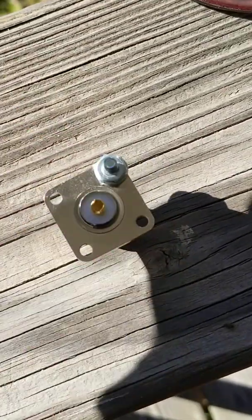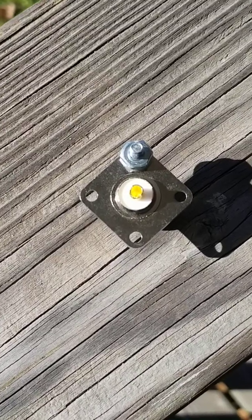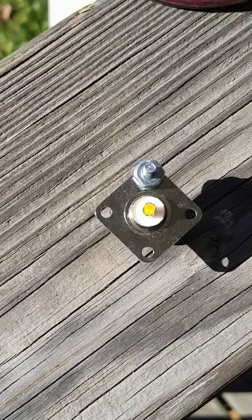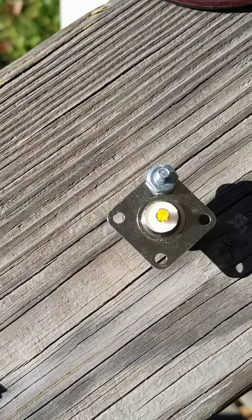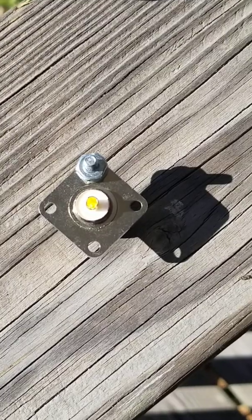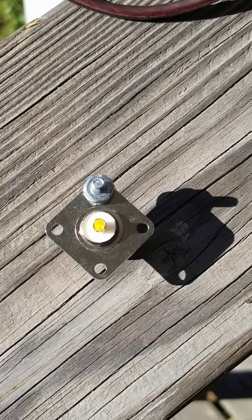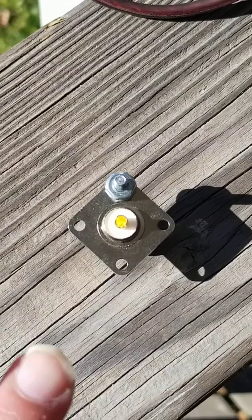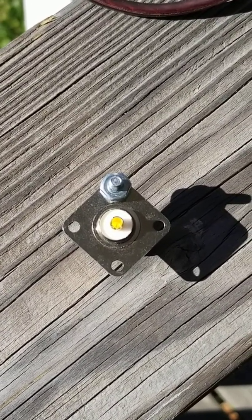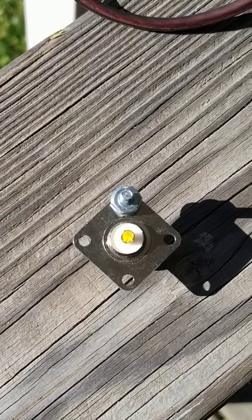I'm not going to solder this today — I'm going to give you guys an idea you can work on. If you guys can give me an idea how to build a gamma match in the future, that'd be cool. If you guys have ever made a three-element beam antenna for CB radio out of speaker wire, let me know in the comments. I saw in a CB Facebook group that someone built a two-element antenna out of broomsticks for CB band for skip. If you have an antenna analyzer like the nano VA, you can run your nano VA on it. Make sure you get a fresh coax wire like CB coax, like an RG58 or longer — if it's 50 foot, the SWR should go lower. That's how you trim the wires down to get the right tune.